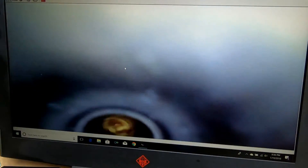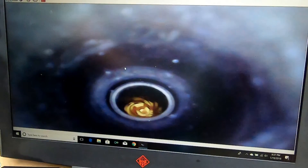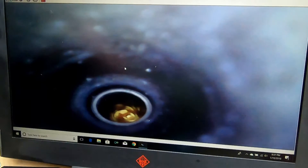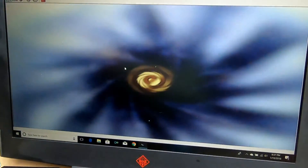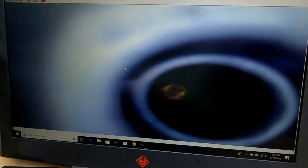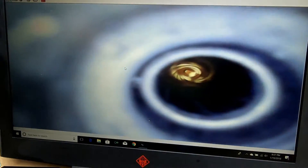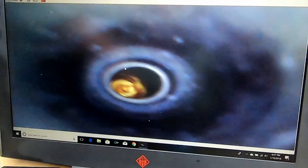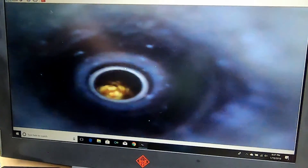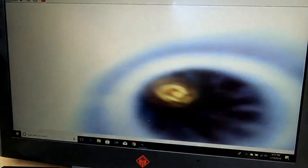Let's see if we can pick up our case neck. Into the barrel — we're into our neck. You can see where our case rim is. We don't have any buildup there, which is a good thing. I don't cast for .223/5.56, so I wouldn't expect to have any. Trying to get a good focus on the lands — that's a little bit harder to do. Backing out of the chamber, we got a little bit of dust, looks like maybe some powder residue there.